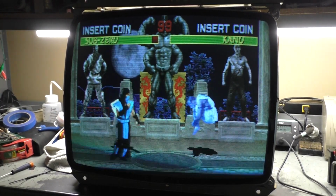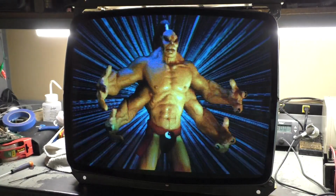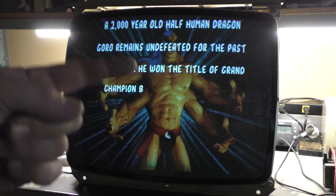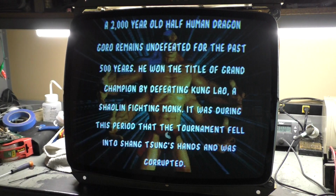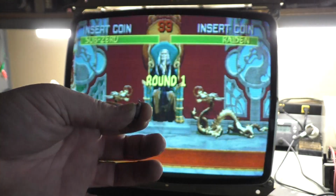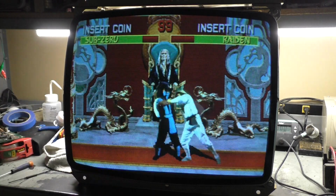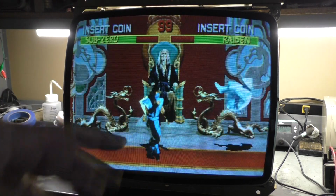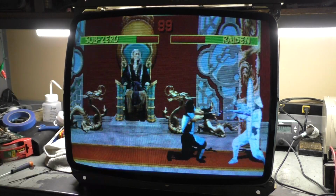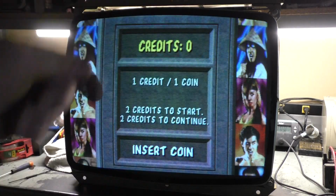Wow. Well, there you have it. Neotec 2515C, brought back from the dead. Oh, I forgot, because I already threw it away, but we had a bad switch mode power supply chip. I already threw that in the garbage, so I forgot to include that. So we had a bad switch mode power supply chip that was keeping it from turning on. We had an open R120 that was keeping it in collapse. We had a bad RGB encoder chip that was the cause of no blue, and we had a faulty flyback that was causing ticking noises and chirping sounds when it was operating, so that was going to get changed anyway. But yeah, after a full reflow rebuild and replacing these parts, we are good to go.